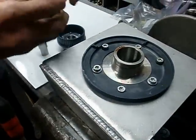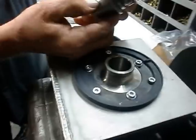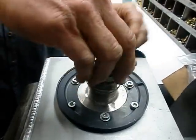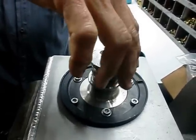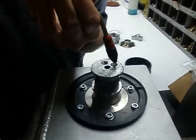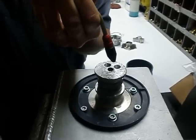Once we do that, we've developed a little testing tool. We've welded a couple of the ports on the side of this and we've drilled a couple holes straight through so we can actually see the action of the cam gear. Again, it just falls down — there's no binding whatsoever. In this position, we use some air, and right here we can see the actual movement of the cam.